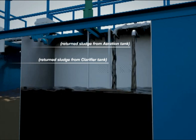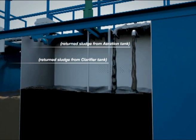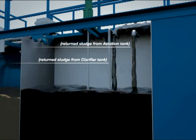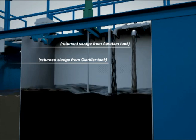The oxygen is absorbed by the bacteria in the return sludge. The bacteria use the raw sewage as a carbon source — food for metabolism and growth. With low dissolved oxygen, typically less than one milligram per liter, the nitrates and nitrites are used as an oxygen source for the bacteria in the mixed liquor.